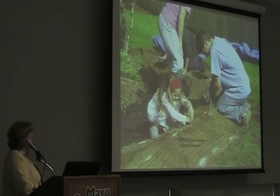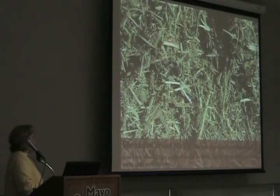This is the berm. When we remove soil here, we build up this berm. It can be seeded with native grasses, sedges, and flowers. It can also be covered with erosion control fabric — this is an example of that, just staked in. And this is the type of mulch we use: roughly cut, so it sticks together and forms a mat. It won't float to one end like bark chips would. Cheap mulch — doesn't need to be dyed or sprayed.